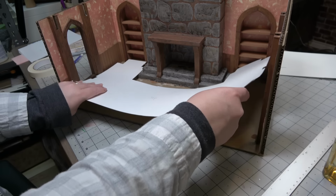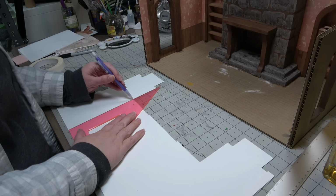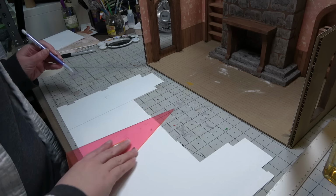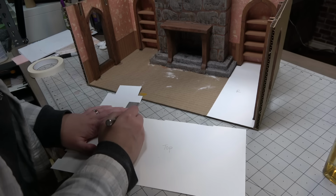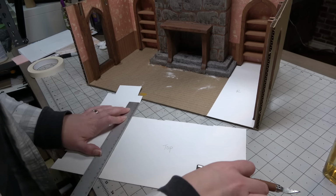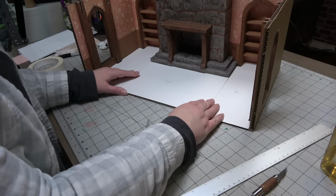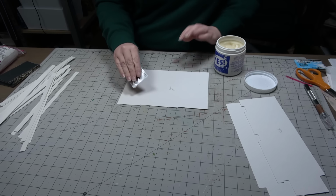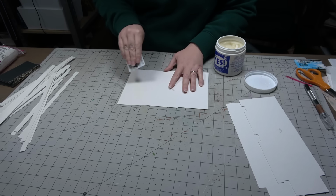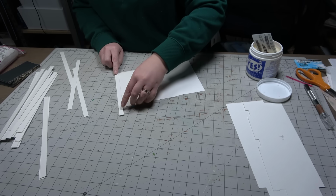When I went to fit it back into my room, I realized that there were too many angles, too many columns for me to get it in as one large piece. So I decided to cut it into 3 individual pieces, and this does mean that I'm going to have the floorboards of my floor going vertically as compared to the fireplace, so that I can easily disguise the connection points between the 3 pieces of flooring.